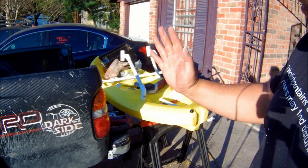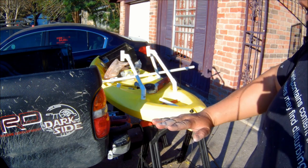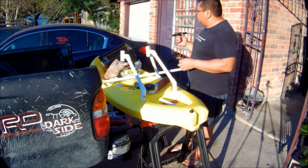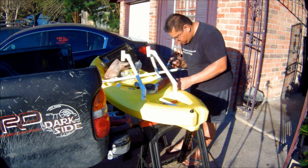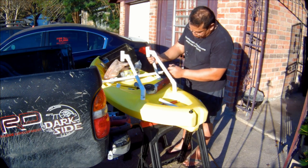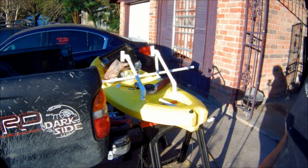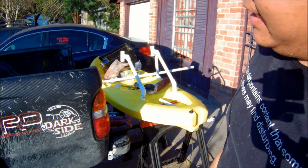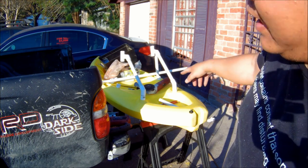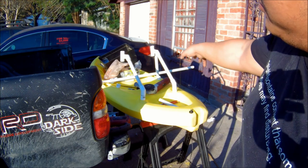Since it angles that way, I want to make it sit straight up some. So I'm gonna heat up the PVC and try to bend it back straight. You can see it's drained out some. Just remember, whenever you're heating up the PVC, you don't want the flame to actually touch it, and you want to keep it moving so it doesn't burn the PVC either. Eventually it'll get warm enough to where it'll flex, and then you should be able to move it into position.